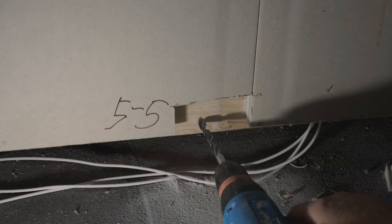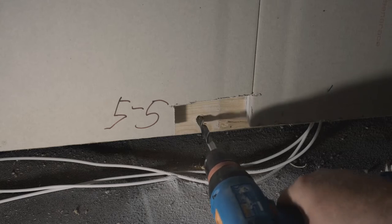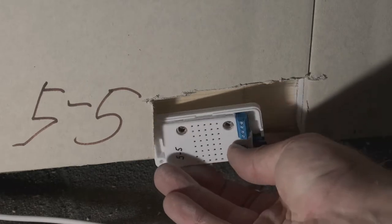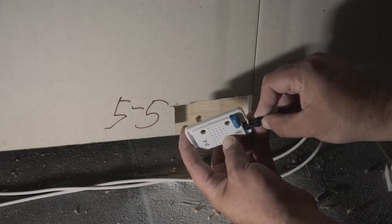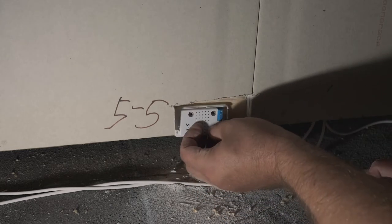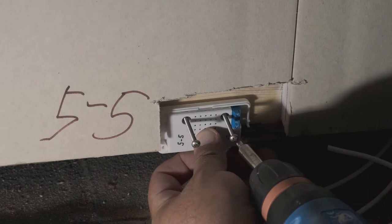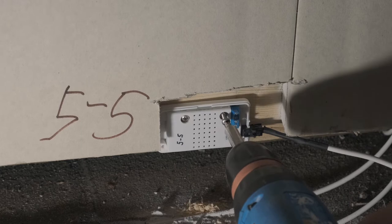Using a 10mm drill bit, drill a hole for the center basket for humidity and temperature measurements in a cavity of the wooden material. Next, fasten the sensor using the supplied longer screws. They also work as probes for wood measurements. Tighten the screw sufficiently and cover the sensor by the covering lid, fastening it using the shorter screws.